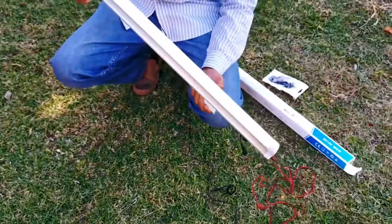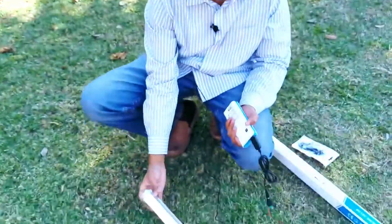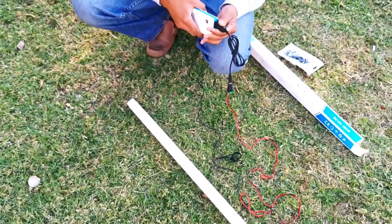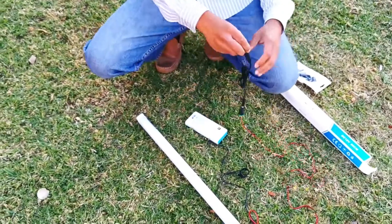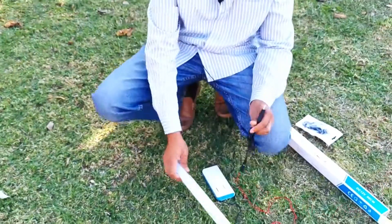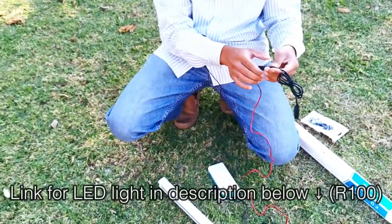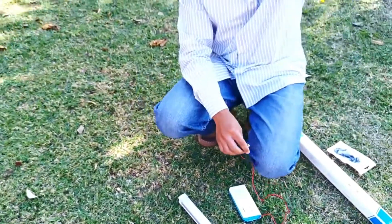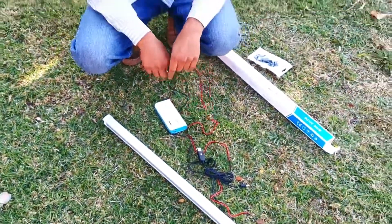You don't need to burn candles or use those little LED torches, because the advantage with this is if it's mounted at the top — say on the ceiling or somewhere high — it's going to give you adequate light, even if the kids need to study. So what do you need? A power bank, this LED light for about 100 bucks — I'll post a link in the description — and a USB to 12V converter, and you're done. Thank you for watching.